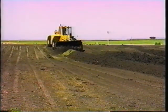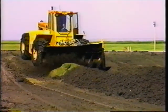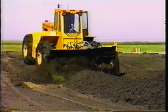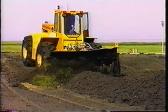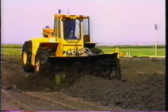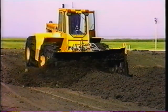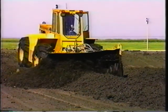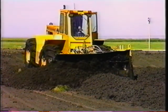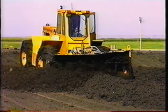The Brown Bear auger aerators are the only turners that build their own windrows as they dry the material, increasing the exposed surface area, which increases drying. As you can see, the aerator's reverse rotation works the windrow from the bottom up and to the side, aerating all material to ground level. This method of moving and reestablishing the windrow in one pass means maximum oxygen incorporation and eliminates the chance of anaerobic pockets.